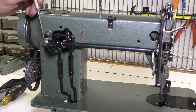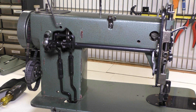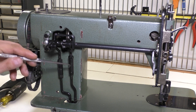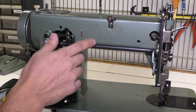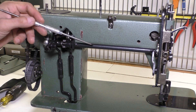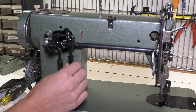Next, these are some additional bolts that basically hold on to the feed tube and the lift rod — this is an interesting mechanism. The feed tube is the outer tube you can see here, and then the lift rod actually controls what's called a lift crank that runs inside of the tube. The lift crank controls the mechanism so that things go up and down, and the feed tube controls the motion of the outer presser foot. Make sure that these are tight.